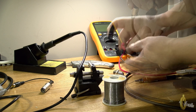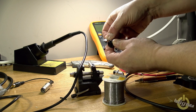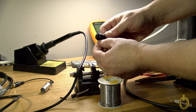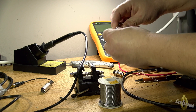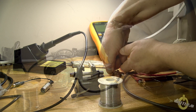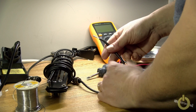Now put some electrical tape around the PTT switch, and it will have a very tight press-fit into the XLR connector. I have one I did a few years ago that has never come out. That's why you need to buy the correct size of momentary switch — then you have a good PTT switch built right into the XLR end.